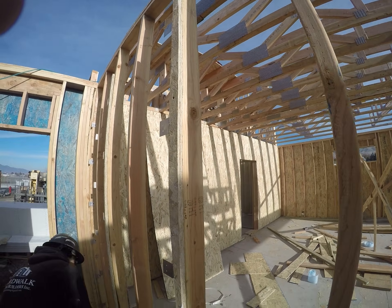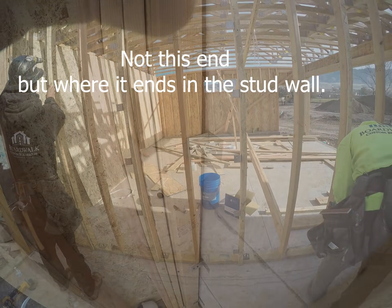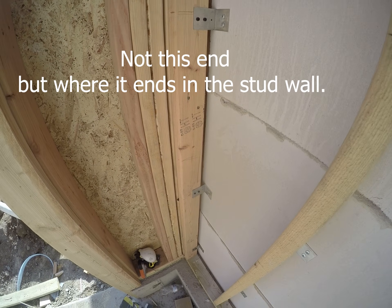In our case, they're installed eight inches up and eight inches down, alternating on each stud in relation to the light core sheet, with one clip left out at the end of the sheet.